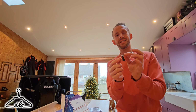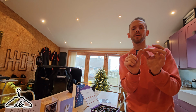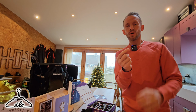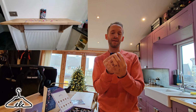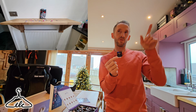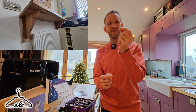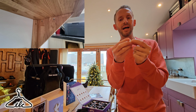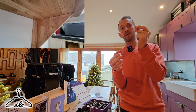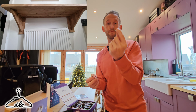But I've got 40s and 50s in my toolbox also. So they're 50mm long. If you see in the photos, I had to fix brackets to the wall. This is what I made for a customer. I made those brackets, you can see right at the top, in the picture up there now. I needed to go through the bracket of 20mm, and this wasn't really going to cut it, because I had to get through the bracket and into this and tighten up, and I didn't think it was long enough. So I simply used a 50mm version of this, a 5x50.